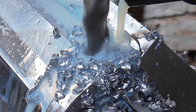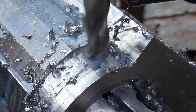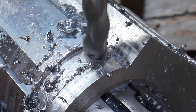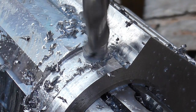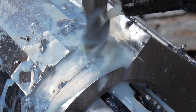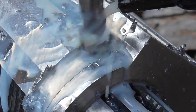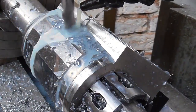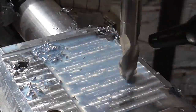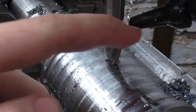I'll pull back so I can see what we're doing, then lock the dividing head here, pull them back on, unlock the X, and away we go down the length. Well, that was interesting — it's a pretty reasonable surface for the size of cutter I was taking.